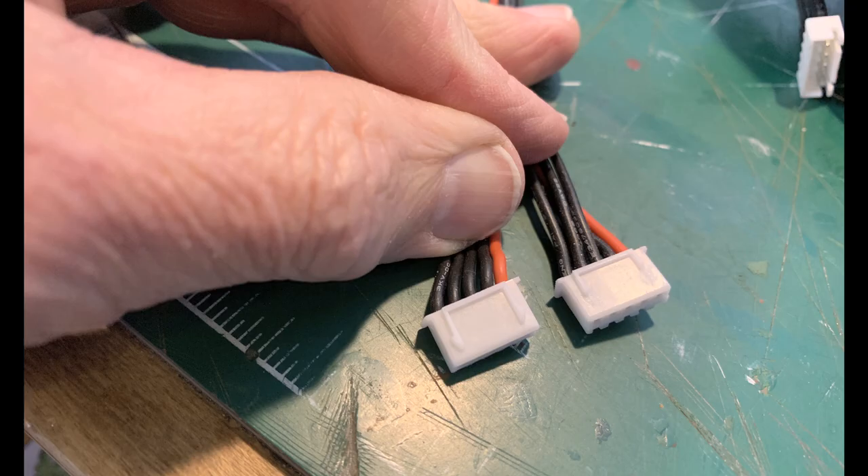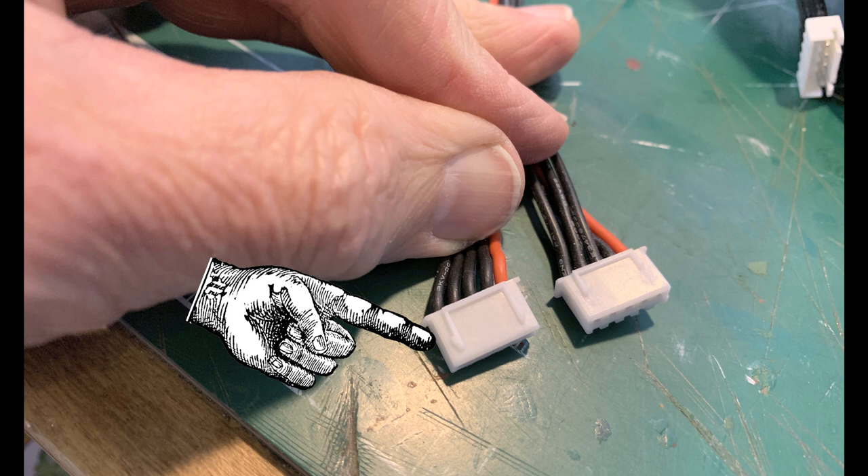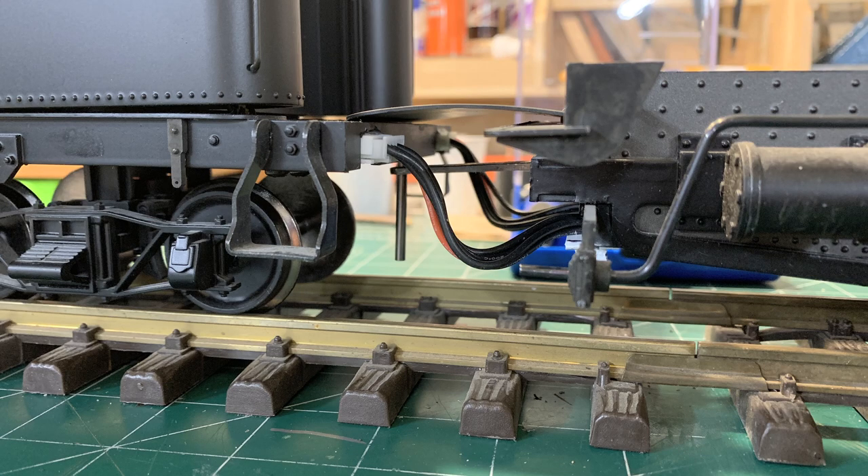The other end of the cable that runs from the locomotive and drapes down to plug into that connector — I just have to match that color coding on the wire. Notice the little arrow point on there: that's designed to lock it in so it can't come loose in an RC car tumbling through the desert. But it makes it incredibly hard to unhook from the tender. So I just went in with a diagonal cutter and cut those little arrows off — now they slide right in, hold very securely, and come right back out.